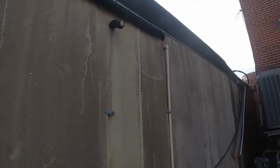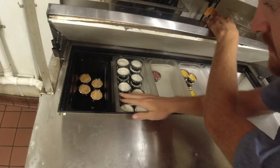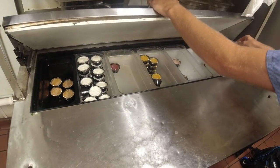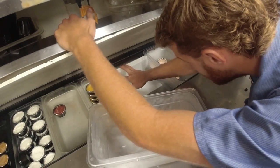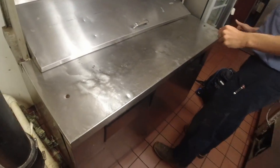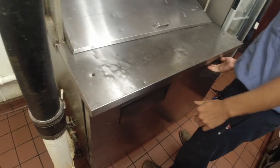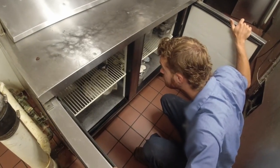Let's focus on the ones that are leaking water - those are the big ones. Every single one of these is still getting water. They may have had ice in there, or it could just be condensation. It doesn't look frozen. He said it's cooling okay, so it may not be a refrigeration issue - right now it seems like a drain issue. Let me see if the pan's filling up with water.